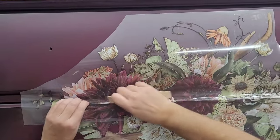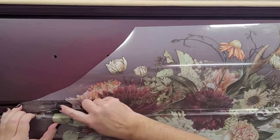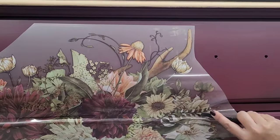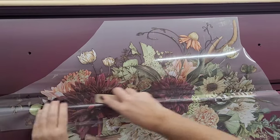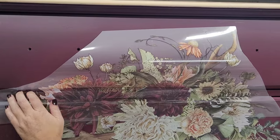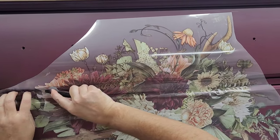I have to go over a drawer crease here, so I stair-step the transfer, working just one area at a time, then use my razor knife to slice in between those drawer seams. I use my fingers to wrap the transfer into any of those creases and the moldings along the edge of the drawer, working one section and then moving up to the next.